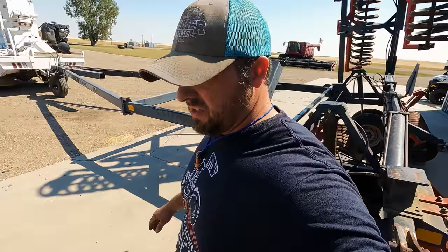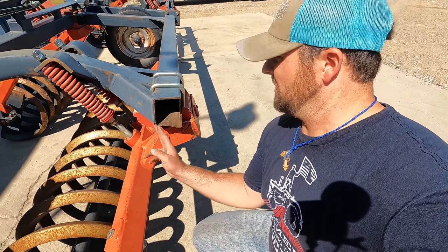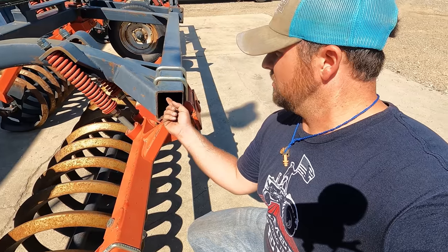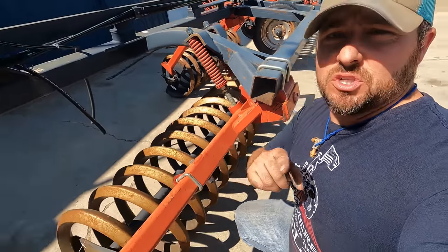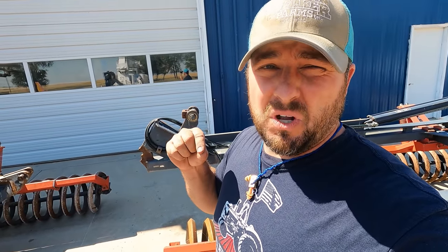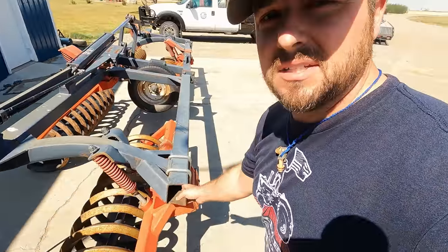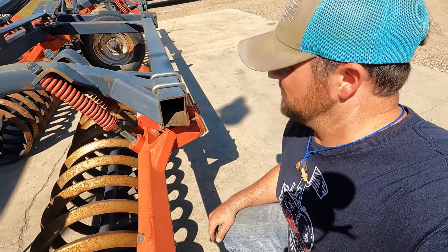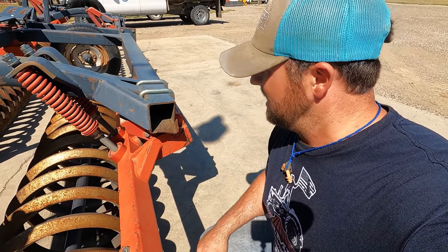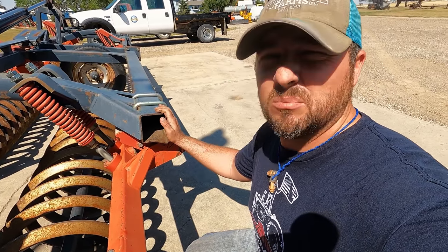And then for this over here, what I'm gonna do is I'm gonna take flat iron pieces, I'm gonna stick them on the inside right here. They're gonna go all the way, so it's gonna have a little lip. I'm gonna weld them inside, and then when I slide the tube that's on that side right over it, I can get that welder super, super hot and just burn right through into that plate that I'm sitting inside here. So then that way I can get a nice hot weld all the way around this outside, and then I will plate this so it doesn't have any more breakage points.